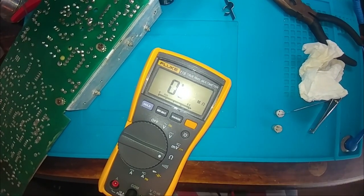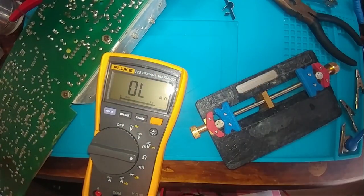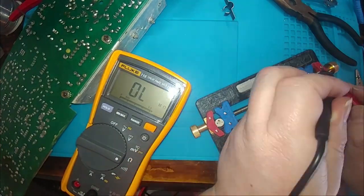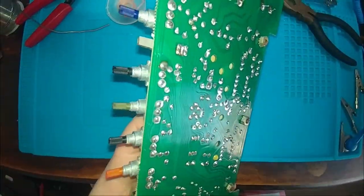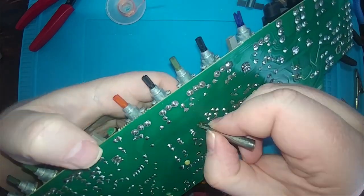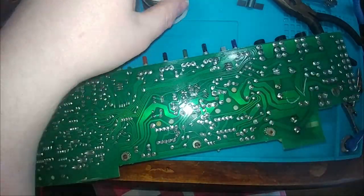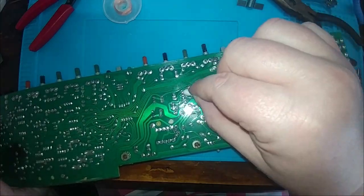However, again, depending on how they are in circuit, they could always be latched on or turned on like an on switch. So again, like I said, sometimes it's just best to test out of circuit versus in circuit. Now, as we pick up here in a second, I decided to test around the board with other components, and ultimately found a very low resistance, low capacitance capacitor that I wanted to test out of circuit as well, just to make sure that it was good. And that's where we will pick up on the end of this montage.